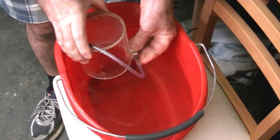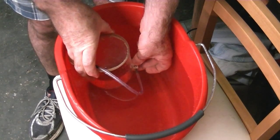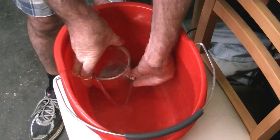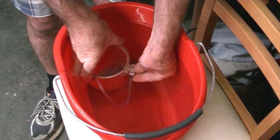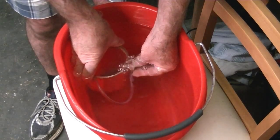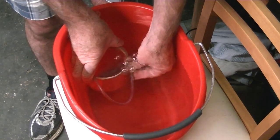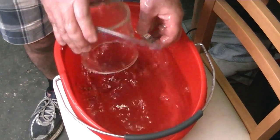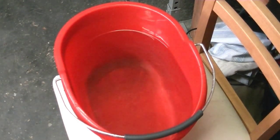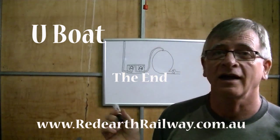Finally, I'm just going to show you the relative positions of this valve with the ballast tank. What you can see here is an open-ended canister — it's the cover for the motor room, so the bottom is open, and it's got a tube in the top. So I can use it for testing this valve. You can see when the valve is up high next to the tank, the air bubbles out. When it's down low next to the tank, it doesn't — that's the bottom line. So I now keep the valve quite low in the hull and it works terrifically. I hope that works for you — it certainly works for me, and it works for the boat.